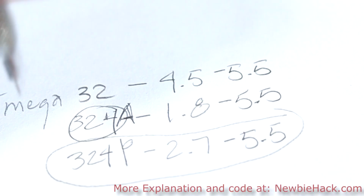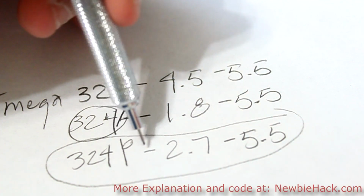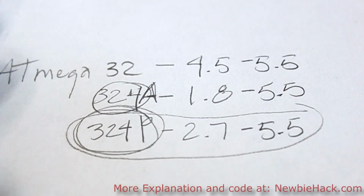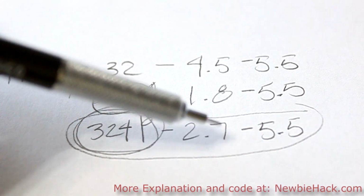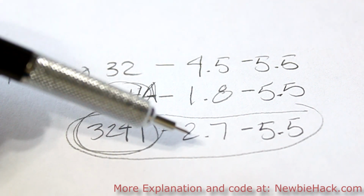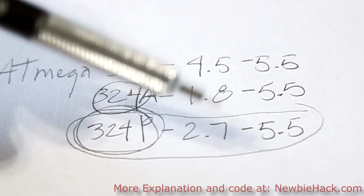But since most peripherals range between 3 and 5 anyway, this is a perfectly appropriate microcontroller to use with these tutorials. You'll want to adhere closely to these ranges as much as possible. You don't want to go below the minimum voltage, because obviously you won't be powering your device. And you don't want to go over the 5.5 because you might cause the chip to be damaged.